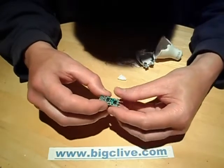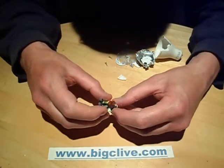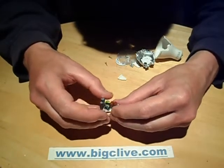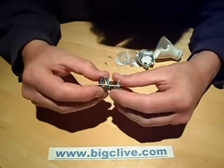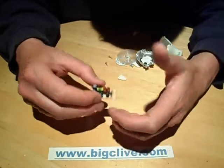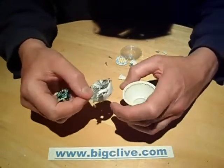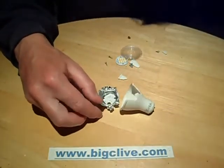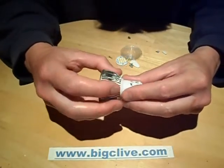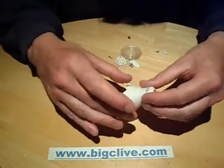It's quite an unusual thing to find in one of these lamps. Most other lamps seem to use BP semi chips, which are sort of dedicated 3-watt LED drivers, so it's quite refreshing to find something like this — quite an interesting alternative to the usual circuitry. Maybe that's because this lamp is so isolated inside that they can use a supply that's directly referenced to the mains. With these type of lamps you'd really want some sort of isolation in case there was electrical connectivity to the metal shell, but with the all-plastic housing that's not so critical.